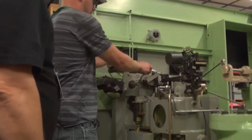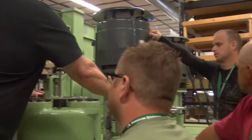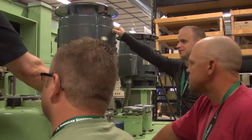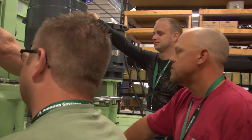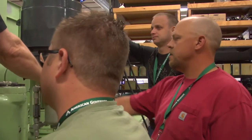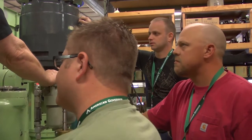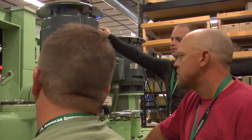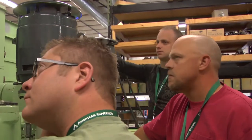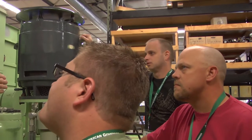Calibrating this stuff. We've got the pitch blades, so much more linkages and stuff. You've got the two distributing valves, right? One for the blades and then one for the gates. But the linkages to this are the same. The blades will all have their own little adjustment off to the side, up and down, and probably a stack of cams down at the bottom.